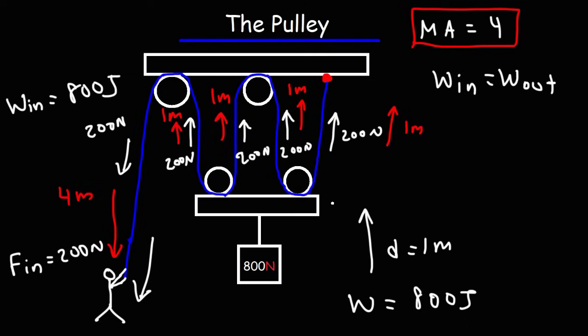With this type of device, you can have any number of ropes. If you were to use 10 ropes, your mechanical advantage would be 10, which means your force will be multiplied by a factor of 10. However, you will have to pull down the rope a distance that's 10 times as much — so by pulling the rope 10 meters down, the crate will only move up by one meter. That's the cost you pay for force multiplication.